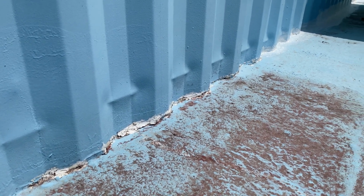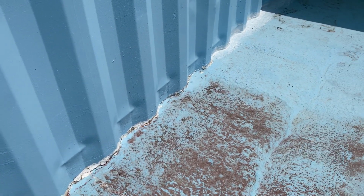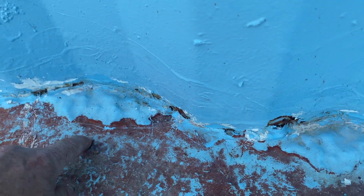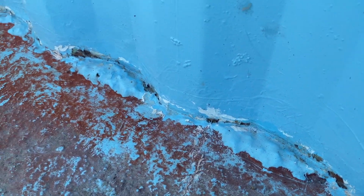Like I said, it pretty much held the leaks, but as you can see, I had to do it in a lot of different places. So I spent literally hours under the water with that scuba mask. So I've gone ahead, I've scraped away any of the layers of epoxy, if they're not bonded to each other. Worst case, I came away about 1 inch or so, but up the side, it was okay. It seemed like all the flex was on the bottom.